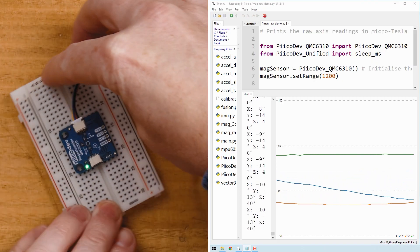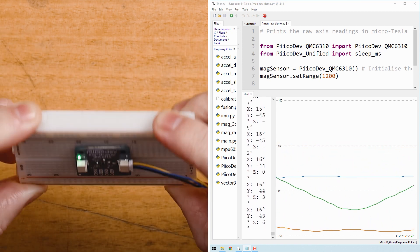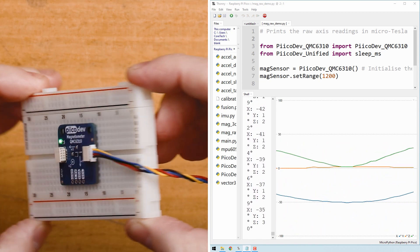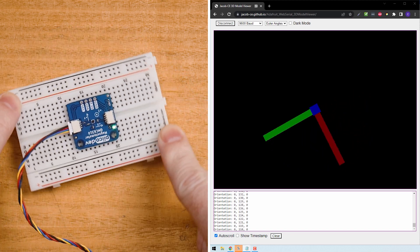But what if the sensor fusion from a 6-DOF isn't good enough and you need heading as well? You're going to need the last three degrees of freedom — direction — which brings us to our final type of IMU: adding a magnetometer to the accelerometer and gyro combo. A magnetometer measures the strength of its surrounding magnetic field along three axes of 3D space, and a 9-DOF IMU uses it as a digital compass using Earth's magnetic field for three axes of direction.